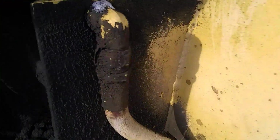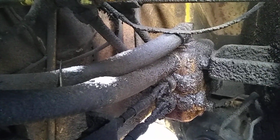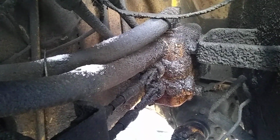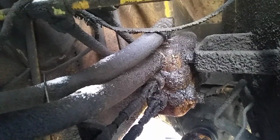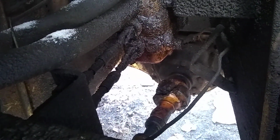There's a valve body I gotta get into way up in there. That's not that right there. And that controls the tilt and the forks up and down. I actually do got a bucket for this out back. I gotta pull that apart. A couple cables right there. Probably put these seals in there. I think the hydraulics are bleeding over. That's a dry stick. Yeah, this will clear up in a minute.